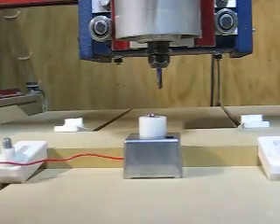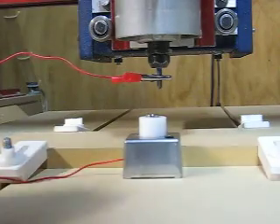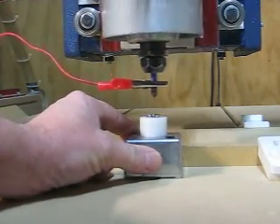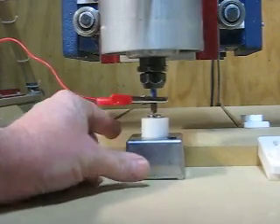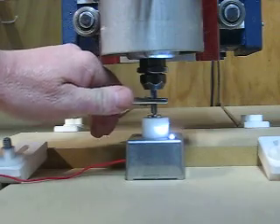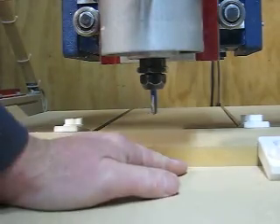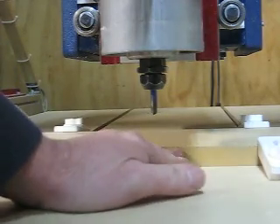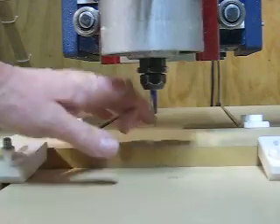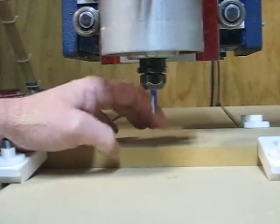So what I do when setting zero to cut through the bottom is simply attach my clip to my cutter, bring the cutter forward until it is over the table, and zero it there. We are now 50mm above the table top. With a bit of maths we can work out that with 18mm of material — which is what I told VCarve Pro the thickness was — the top surface of the material is at 32mm above the table. So I simply enter my Z height as 32mm and Z is zeroed.